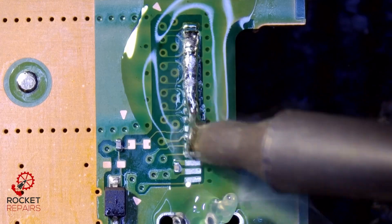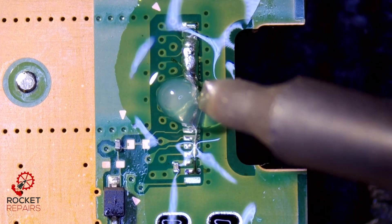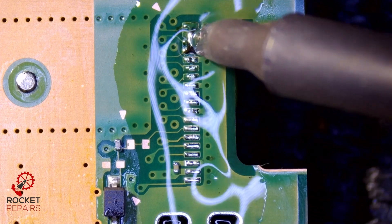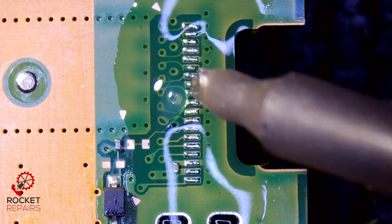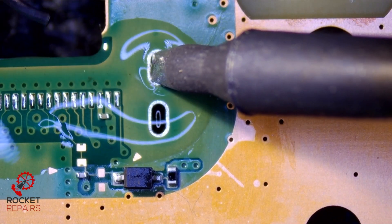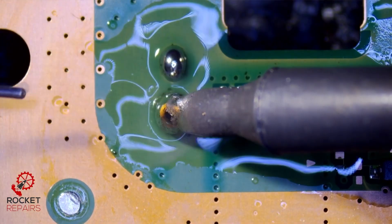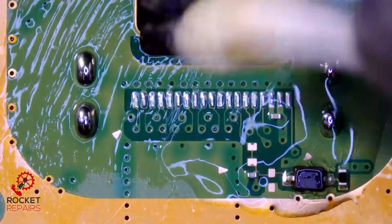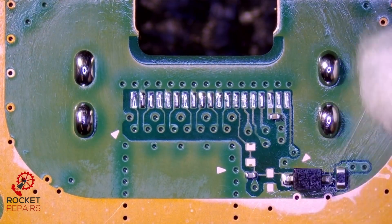I'm just going to run my iron back and forth just here — way too much solder, not enough flux, might have to wick this away. Soldering the ground holes — plenty of it as well. Looking nice. One last clean of this flux before we apply some new flux for the new port. And as you can see, we are prepped — ready to go now. Just apply some flux and drop the port on.